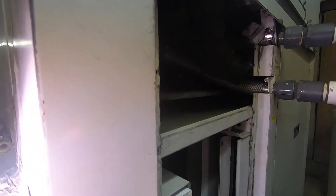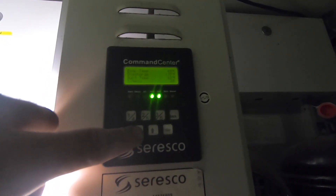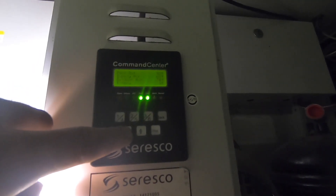No more leak - they were losing a lot of water obviously from the leak. My pressures are good, I'm gonna put this back on. Superheat's 12, pressure's a little high but it's okay. Just turned the system on. Suction temp is 62 and the evaporator leaving air temp is what I want to see.